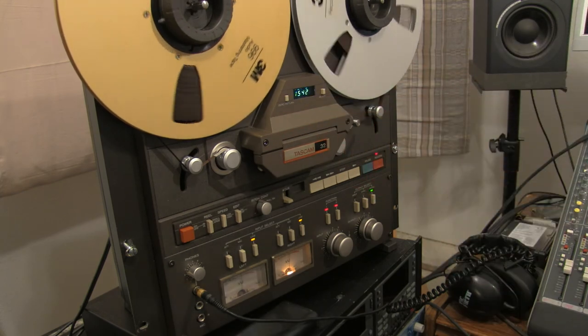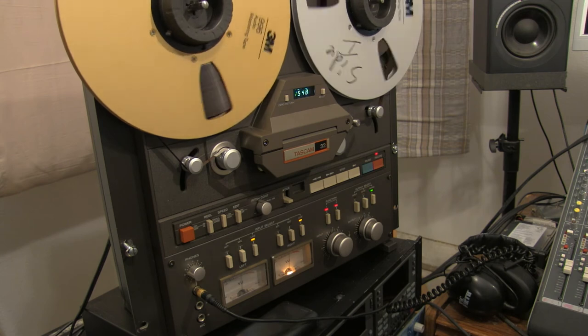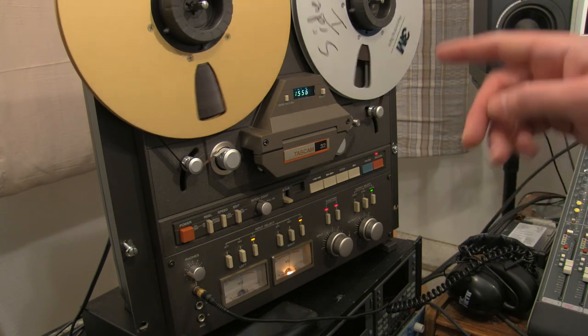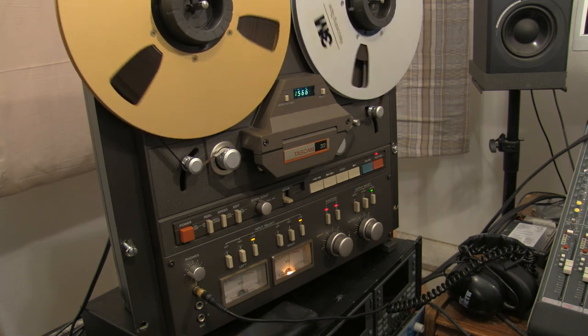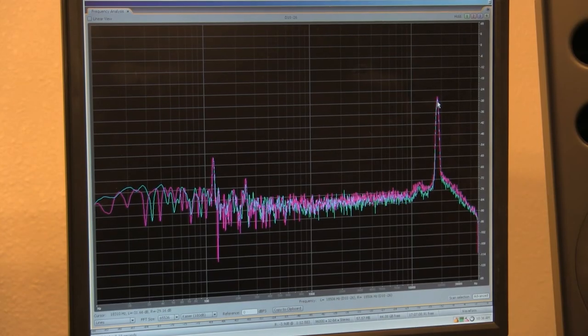What it was is the zenith of the erase head was skewed — it was at an angle which prevented the tape from making perfect contact with the record head. So I ironed out all that, and it took a good hour to get everything set straight. It's pretty good now — within 0.25 dB, which is not perfect. That's 16 kilohertz at 7.5 inches per second, so it's pretty good. If I was going to get it perfect, I would have to send it out to JRF Magnetics, and the bill goes through the roof. At 15 IPS, I'm minus 2 dB at 40 Hz and almost 32 kHz — very impressive. At 7.5 IPS, we're minus 2 dB at 35 Hz and about 18 kHz, which exceeds factory spec.